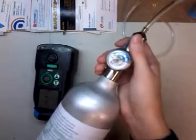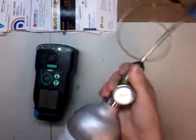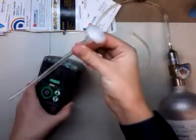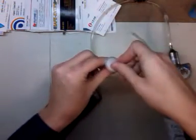A demand flow regulator will handle the calibration with no problems. In that case, just take the regulator, screw it right on — there are no knobs to turn. In my case, when you hear gas flowing, go ahead and turn the regulator off, then continue screwing it in. You'll notice a port on the top — this is where we connect the gas when it's time to calibrate. Make sure any additional fittings are screwed in nice and tight so everything lines up.